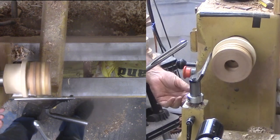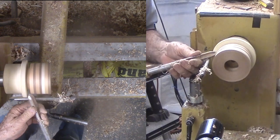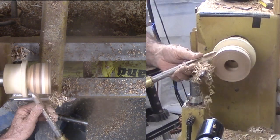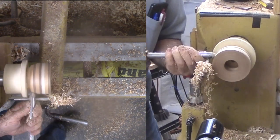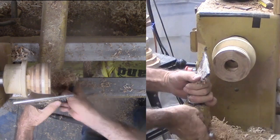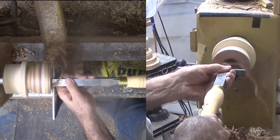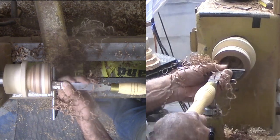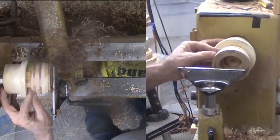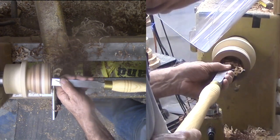With all that preparation work finished, I can start on the bottom portion of the bowl. The exterior has points at the joints and the wood is hard and dry. I am not super aggressive with my gouge to avoid splintering the wood at the joint until the wood is continuously round. For the interior, my preferred tool is a heavy bowl scraper, shaving stream out continuously, almost as if it were wet — but no, this is very dry wood.